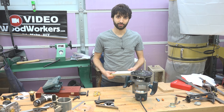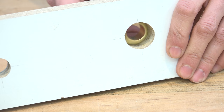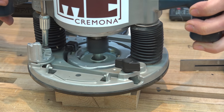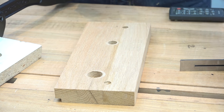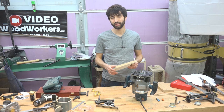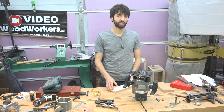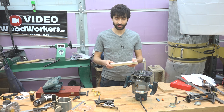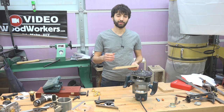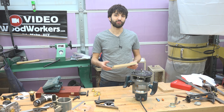If you want to make a bigger hole, that's easy as well. On this end I have a one inch hole — same three quarter inch diameter guide bushing, same half inch router bit — but now there's a little more room for the guide bushing to move, and this setup will give you a three quarter inch diameter hole. This technique is really helpful if you have a large work piece that won't fit under your drill press and you need the hole to be perpendicular, or if you don't have a drill press at all. You can also take a long block, drill a series of evenly spaced holes in it, and create a shelf pin drilling jig — then just walk down the line with the router and drill all your shelf pin holes quickly and accurately.